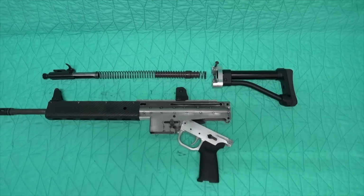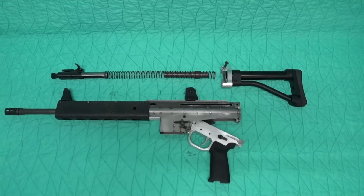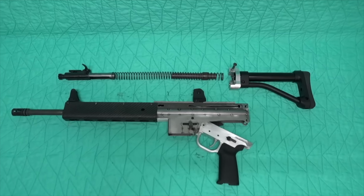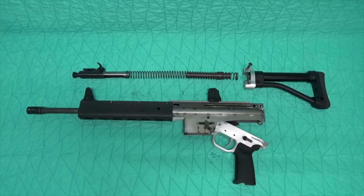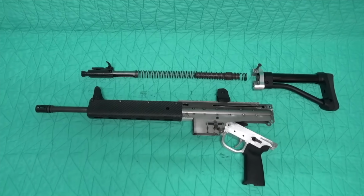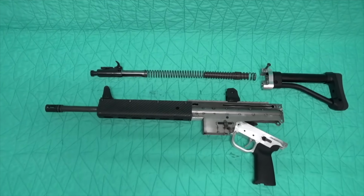So that's good news. Now, I recently had some of the exact same material, same thickness, laser cut, and I found those edges were, a file wouldn't bite into them, and I actually had to anneal the whole plate. But, as with most things, your results may vary.